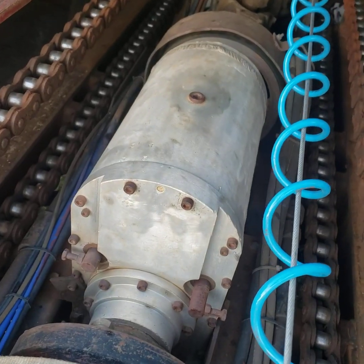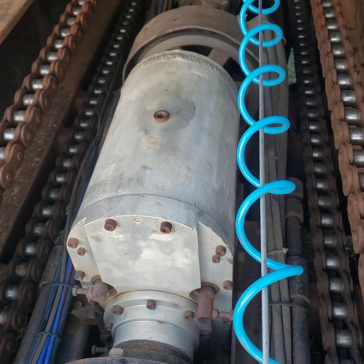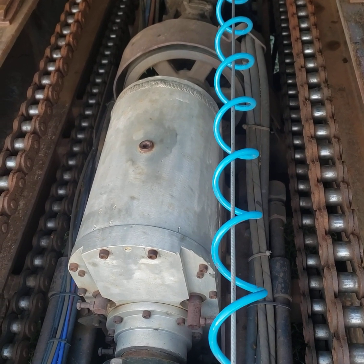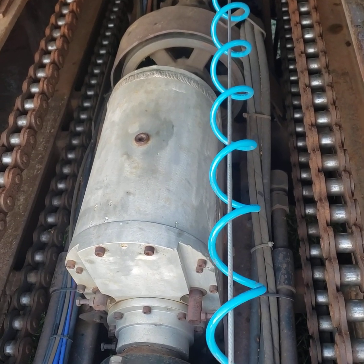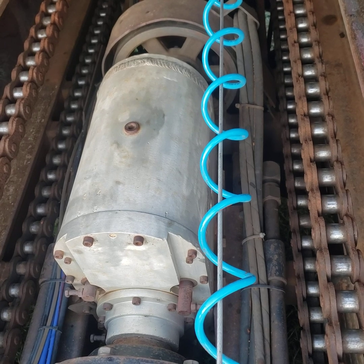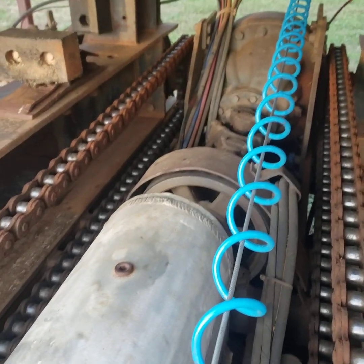Next in the box drive line: the Profab 5-speed gearbox. That's the same gearbox transmission that a lot of tractors, two-wheel drive trucks, four-wheel drive trucks, and different types of vehicles used. The 5-speed here is a twin countershaft — it has an upper and a lower the way it's sitting here right now. That's all we have: five box speeds in these sleds. For this particular sled here, first being low gear, the box will top out somewhere in the 260-foot range. Second gear is about 240. There's a small jump from second to third — about 10 feet — puts it at about 230. Third to fourth is about 20 feet, puts us at about 210. Fourth to fifth is another 20-foot jump, puts us at about 190 — top of the box. And that's if the box is all the way back; I'll get into some of that later.